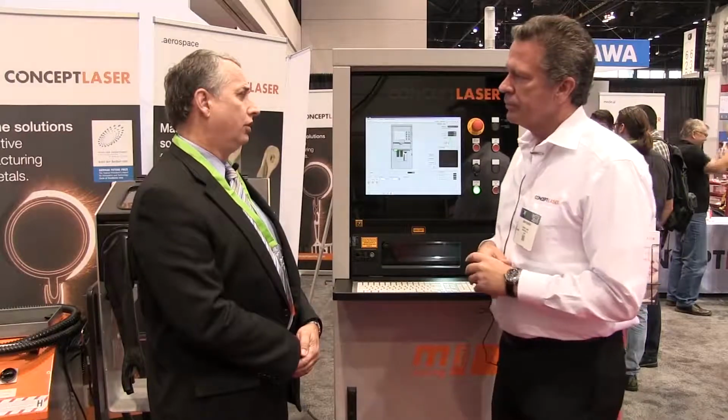An engine block is not only a very large part, it's a complex part, right, internally and externally, but it's also a part that has to be cast ultimately for volume production. So you can't trap or have undercuts in any significant way in a lot of places. Historically, in my experience, 3D printing is a process where you may 3D print the cores and then go and sand cast or die cast the product this way. You're going directly to a finished 3D printed engine block?